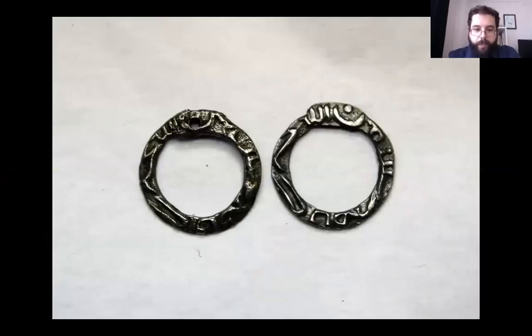Here's a side-by-side comparison of the original ring and one of the replacement rings. The replacement rings were given a 10-minute soak in 5% nitric acid to etch the surface, both to blend in with the etched and worn surface of the original rings and to make it easier for pigments to adhere to the surface. As some sections of the rings were more corroded and worn than others, some batches were etched a little longer than others. The rings were then warmed up with a heat gun and a light wash of pigmented wax applied over the surface.